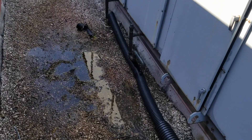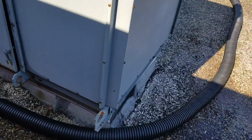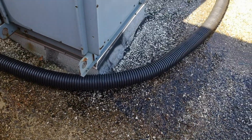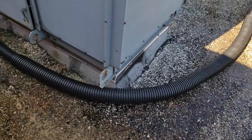When I got here today the pipe was all disconnected and we have water laying there. On the upside, all this water laying on the edge of the base flashing and not coming into the building indicates to me that it is not leaking — it's not a roof leak at the base flashing.